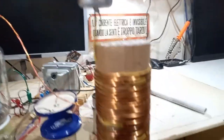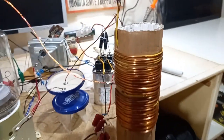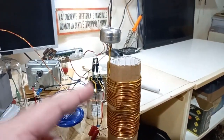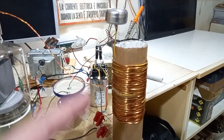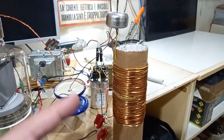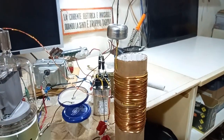About the actual coil here, I made some choices. First of all, spaced windings. Yeah, they are messy, but still spaced — and this is to reduce the inter-winding capacitance and probably have a coil with a more definite resonant frequency. This thing oscillates at 16 MHz, which is ideal at the end, because you have to be above 12 MHz but not too high, because otherwise the efficiency drops a lot.